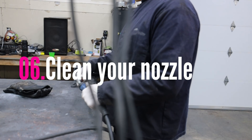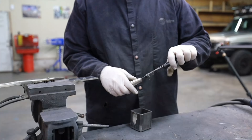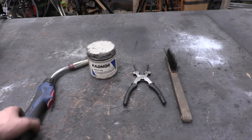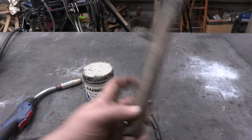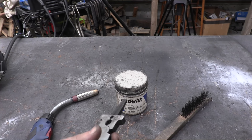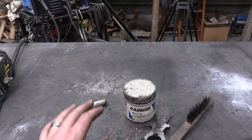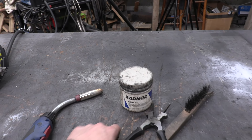The sixth tip is keeping a clean nozzle. Keeping contaminants out of your weld is super important, and the last thing you want is to periodically fight a bad connection from buildup. I use a few strategies to keep my nozzle clean: between welds I'll tap the edge and a bunch of debris will typically fall out. Then I'll take the brush and physically brush the inside. Eventually you need to remove the nozzle and jam the end of your pliers in there — it's made to scrape the inside of the nozzle clean. Once the nozzle is warm, you can dip it in nozzle gel to extend periods between cleanings, but regardless you'll periodically have to pull the nozzle off and keep it clean.